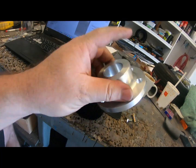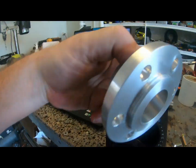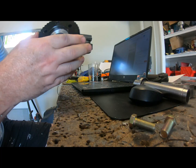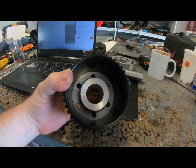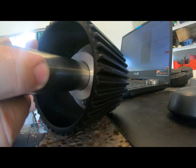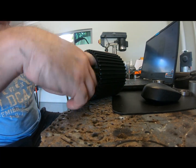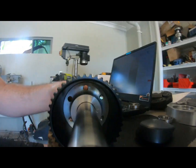I've just finished the lower pulley boss attachment. I've got a radius on that edge, and there's a locating feature on the end that drops in — it's a snug fit. These aren't the final bolts, just placeholders for now. This is the bearing area; this bit here is a press fit onto the lower shaft, so it'll push on there. Then a couple of bolts through the hollow lower shaft will hold the bottom drive pulley in place.